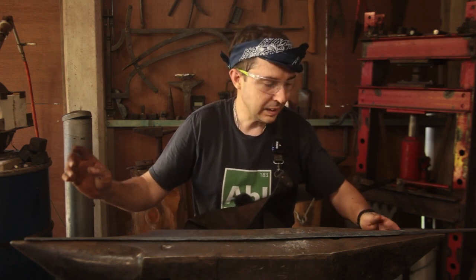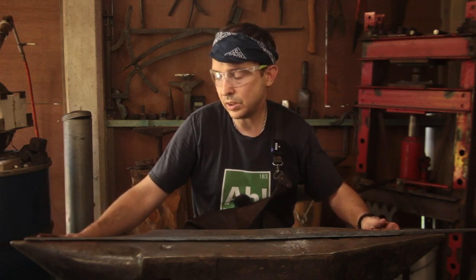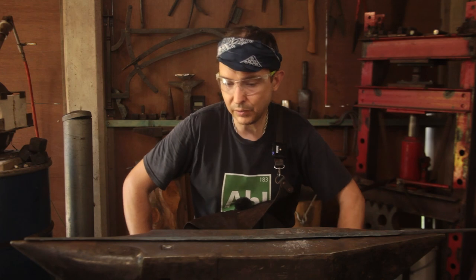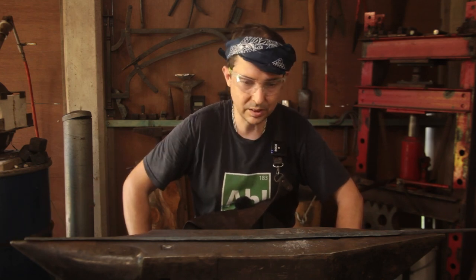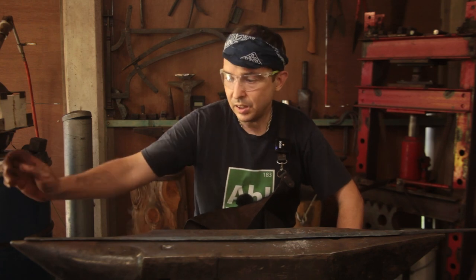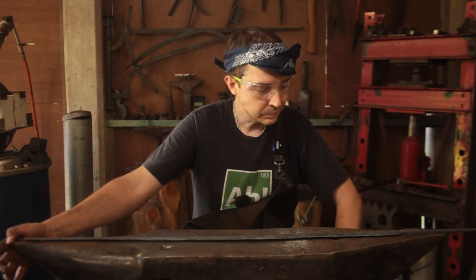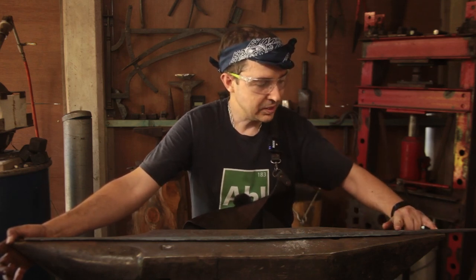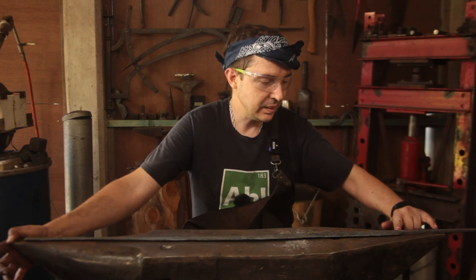We are at 860, not including 2 centimeters that I've left for buffer in case of any little bit of welding at the tip that's not quite perfect. Allowing for the fact that I've already taken a good centimeter off to clean up that. I've got about 10 centimeters worth of the cable Damascus into the tang.